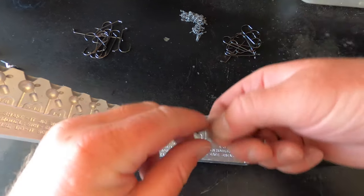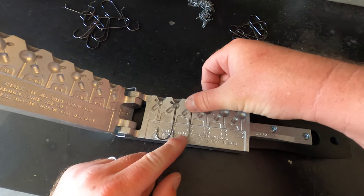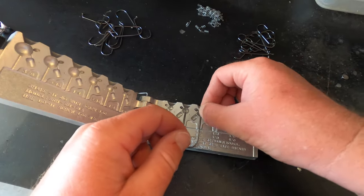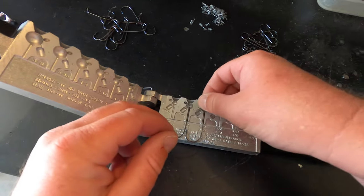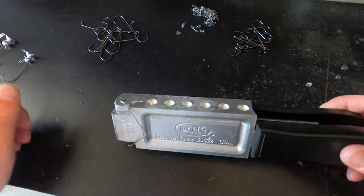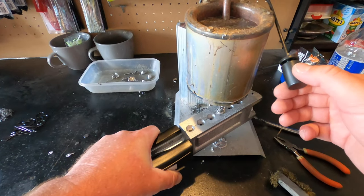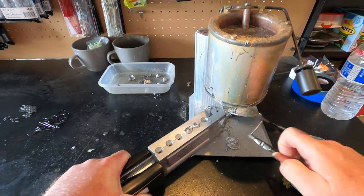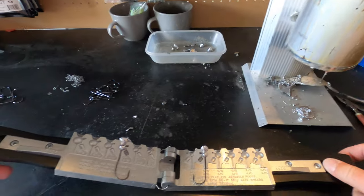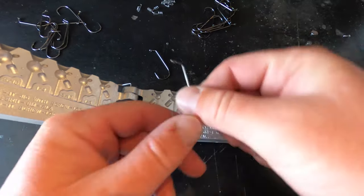Now it's time for round two. We're going to take our 3/0 hook and put it in, then the 4/0 hook, and we are going to take our two screw locks and put them in the mold — just like that — then set the other one in and close up the mold. We're ready for pour number two. Pulling the nail out, we start with three-sixteenth ounce then eighth ounce, put the nail back in, open up the mold — and they turned out really good.